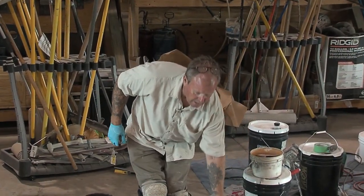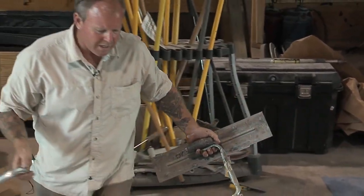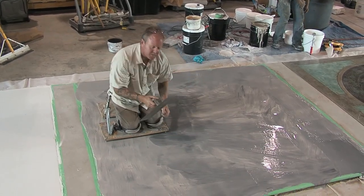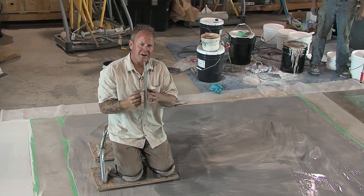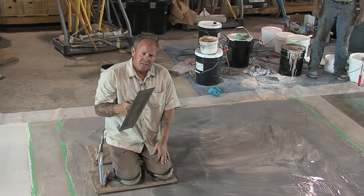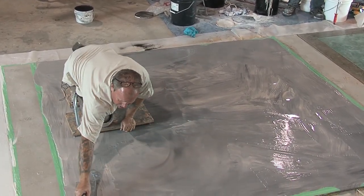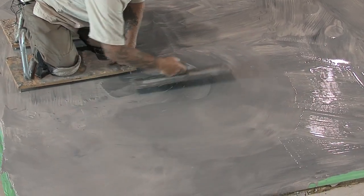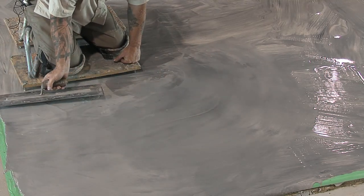We put our first bucket down and a couple of minutes have transpired — probably two to three minutes — which is actually good given it's about 90 degrees inside this warehouse. Normally I would have troweled it by now; the longer you wait, the less it's going to level out. You'll notice on the subject of trowels, I'm using a nice 20-inch trowel. A lot of people would say use a pool trowel, but I want a nice rigid straight trowel because it lays it down flat. My trowel motion is very organic — I'm blending the colors, going in different directions. For best results I like to come back and second-trowel this; depending on conditions, that could be 30 minutes or two hours.